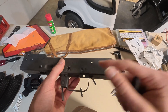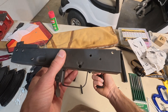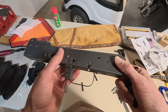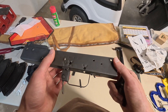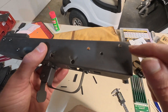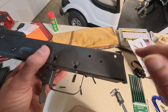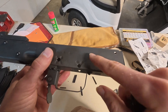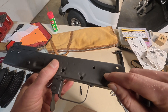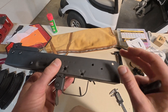Also, if you put an optic rail on here, it's going to be easier — you'll be putting the rivet through from the right side anyways and forming on the left side, so you might as well just do it this way. But if you're going to do an optic rail, you want to rivet this back hole first, and then you can put in your rail and then rivet this one, because the optic rail uses this same rivet hole right here. You'll be using a rivet through this whole area for the optic rail.